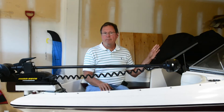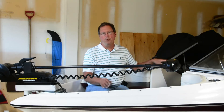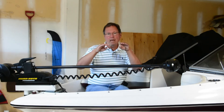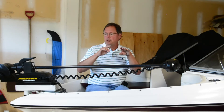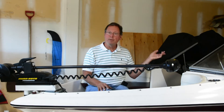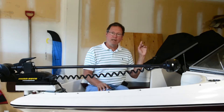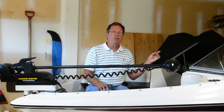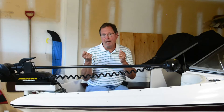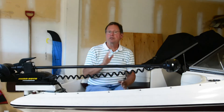Right off the bat, if you have two batteries instead of one battery — whether it's a 12-volt or a 24-volt system — the way the batteries give out energy is going to get better. That's the first thing that happens with guys using 24-volt motors: they have two batteries in the back. Sure, the current goes to half because it's using 24 volts. But by their very nature, the batteries themselves will actually deliver more power over a longer time, just because they're being discharged at a lower current rate. That's an important concept.